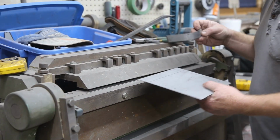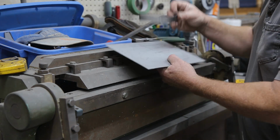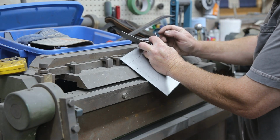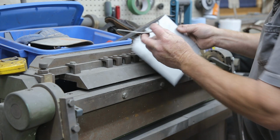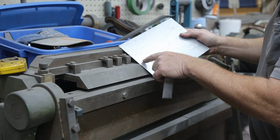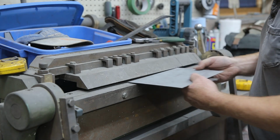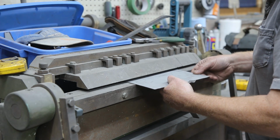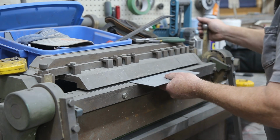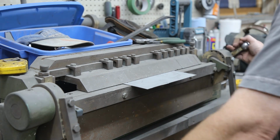So let's build that patch. So we got to bend this piece of metal to kind of look like that. Of course, we're going to have a notch here. It goes 5/8 and then down. But I've drawn that out here. And then here, this is where I want to start my bend. And then these are just every 1/2 inch, I just have some indicators so I know that I'm fairly straight. I don't want to get it crooked. So we'll just get started and we'll just do little micro bends. Just a little tiny bit at a time. They all add up.